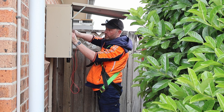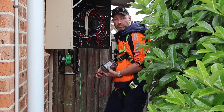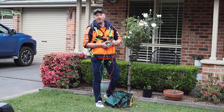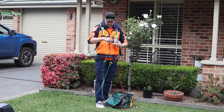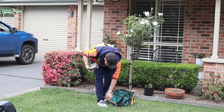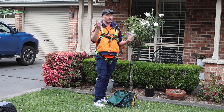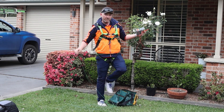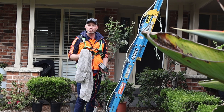It seems to be a good earth to the frame, so I'm happy with that. I've got my earth from the switchboard — now I'll do the earthing continuity test. I only need one of these leads, plug my earth lead into the other side where I know I've got my earthing connection, and then I can go around each panel and make sure we've got earthing continuity — a continuous loop all the way back to earth. A tip for any budding inspectors: get yourself a good trusty towel — nothing will slip off it, and if the roof is slightly wet it's good to dry things off.